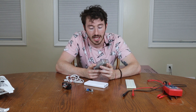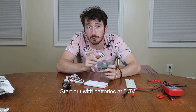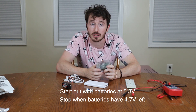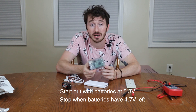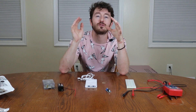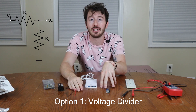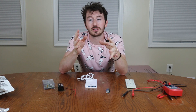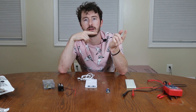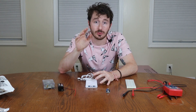I'm going to start by creating different circuits that start at 5.3 volts for each option, and as soon as it hits 4.7 volts I'm going to pull the plug — I don't want to damage the Raspberry Pi. The first thing we're going to try is a simple voltage divider that consists of two resistors. You design it so your input voltage goes through the divider and comes out at a different voltage based on a formula, and you just pick the correct resistor values to get the voltage you want.